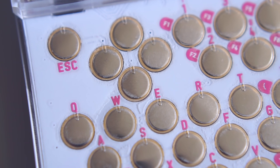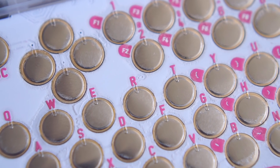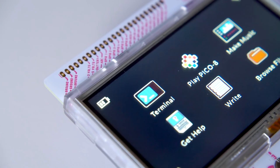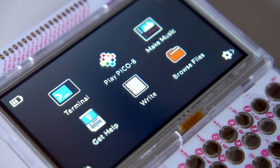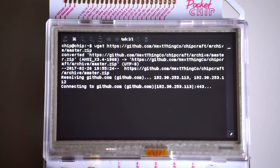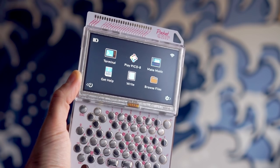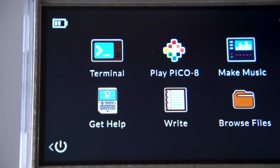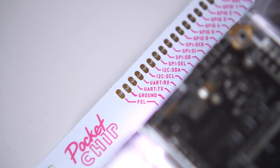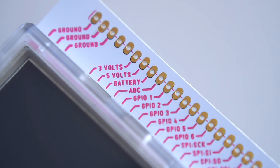The layout is mostly standard, but because of the color and positioning of the screen printing, sometimes it's a bit of a hunt to find the key you want. The LCD screen is perhaps the star of the show here. At 4.3 inches diagonal, it's a generous size for a handheld device, and offers a resolution of 480 by 272 pixels. The resistive touch panel has a matte finish, so glare isn't much of an issue, and the backlight gets decently bright. Above the display is a row of pads that give access to some of Chip's breakout pins, but since voltage is present, you'll want to be careful to prevent creating a short.